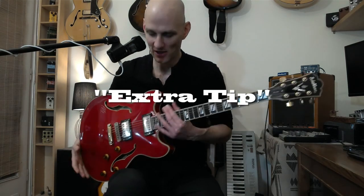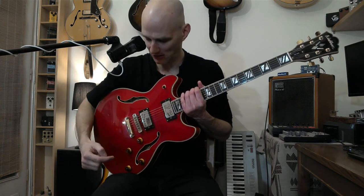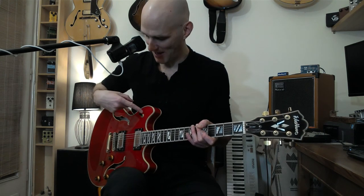Another thing you can do is have a hybrid guitar. So if you have a three-way selector switch, and let's say you like the bridge pickup in the modern method, so when you turn the volume down it shaves off some of the highs, so it becomes almost like a Robben Ford-like tone in a way. Maybe it's not the best comparison, but you know what I mean. Then wire the path going from the bridge switch of your selector switch through the bridge pickup and the controls using the modern method. And then you can wire the neck pickup path using the vintage method.